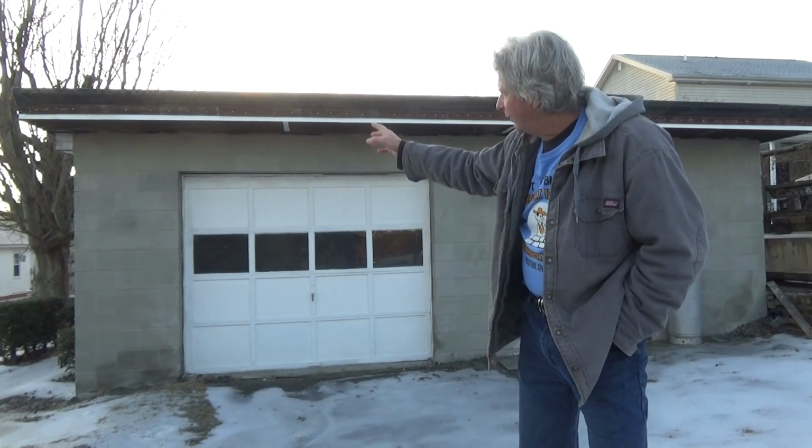So I'm going to stop the video right here because this is 2 months later. It came down and I noticed those dark spots, which were over in here, they disappeared because cement, traditional cement, kind of bleaches itself as it goes. And if it gets wet, like you see on the very bottom where it stays wet, it stays a little darker. Now if I was really worried, if I wanted everything the same color and I didn't want to show efflorescence, I would use a white mortar and a white Portland and paint it with that, and that hides a ton of sins. But the rest of the building was this way and we did it.